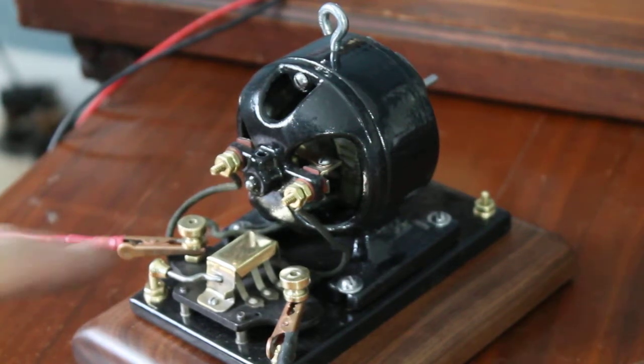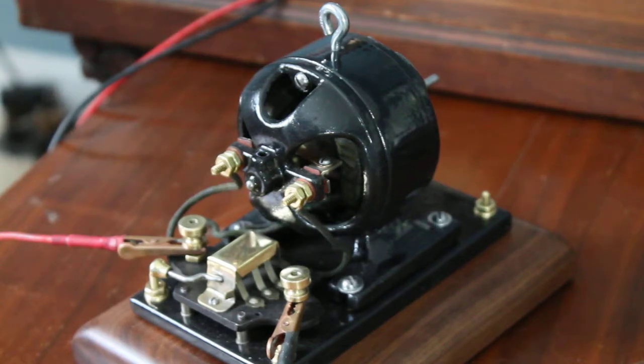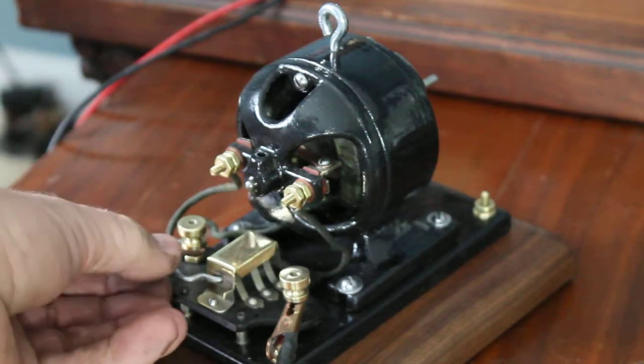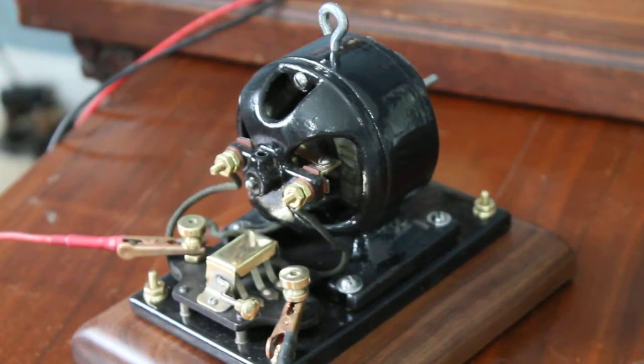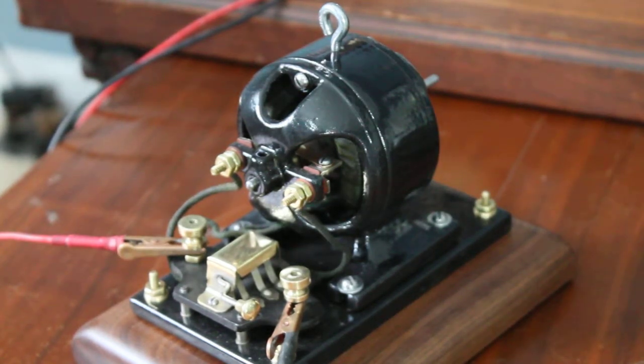You notice all of the switching and stuff. That's because a universal motor, whether it's DC or AC, only turns in one direction. So what they did is reverse the polarity between the brush and the field. By flipping the switch, it goes in reverse. They had to do this complicated thing, and that was their big deal — to design a small electric motor with reverse. They're kind of cool.